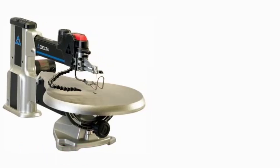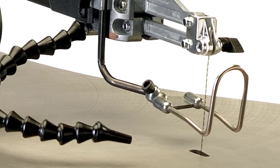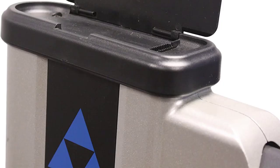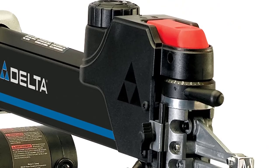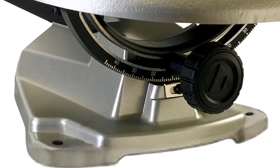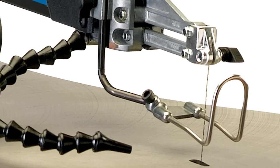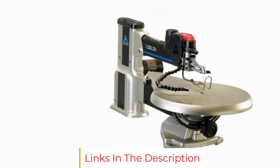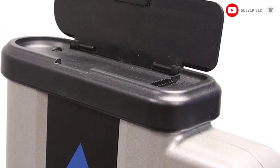At number four: the Delta 40-694 20-inch variable speed scroll saw. Tackle larger woodworking projects with a scroll saw that offers plenty of power and a greater throat depth. This 20-inch scroll saw from Delta Power Tools has more than enough room and power to handle projects of all shapes and sizes. It has a 20-inch throat, allowing for cutting wider pieces of wood than a 16- or 18-inch throat. The table tilts between 0 and 45 degrees for beveling. The upper arm can be lifted and locked into position when making blade changes. It offers speeds up to 1,750 strokes per minute to cut through tough woods like walnut, and a dust hose keeps the work surface free of dust and debris. Out of the box, this saw only accepts pinless blades; a separate adapter is needed for pin blades.